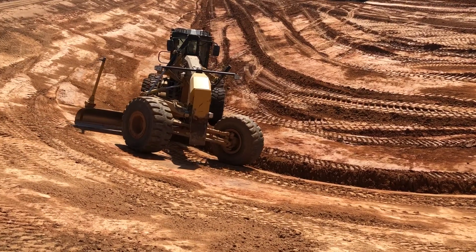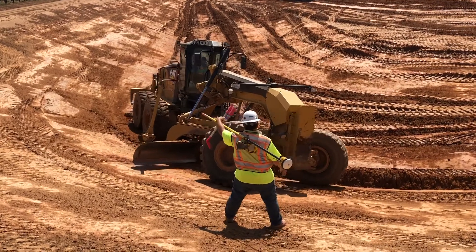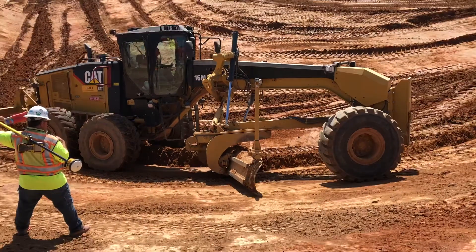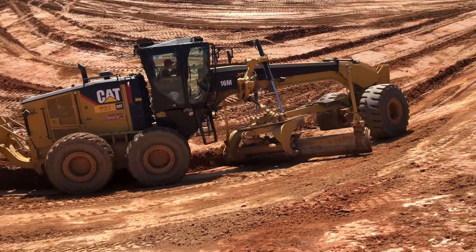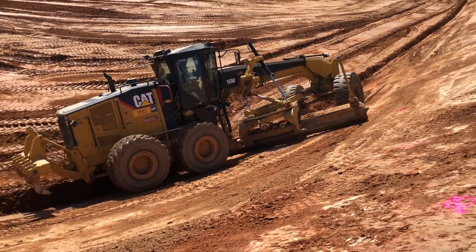Now let's get into fine grading. Fine grading is a different subject and should be treated as a different activity, both schedule-wise and in a bid. Equipment-wise, it's usually composed of very similar equipment, but not identical. Here we have a blade — I believe it's a 14 or a 16 — cutting the slopes on the basin we were looking at earlier. We have a grade setter working very closely with the blade, which is very common. He's painting out cuts and fills for specific areas along the slope so the blade can see it and make its adjustments accordingly. Something to note is that when cutting this basin, the slopes were too steep to finish them after the fact, so as the scrapers were removing material, fine grading had to be done around the perimeter simultaneously — otherwise the blade would not be able to make it up the sides of the slopes to move the material where it needed to be.